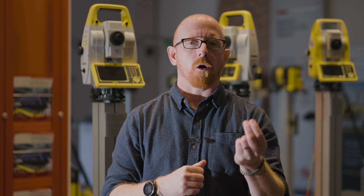We understand from you that you work in a wide variety of conditions and environments within building construction, and we also learn from you that sometimes these conditions are not always the easiest to work in when you're utilizing a robotic total station. For example, when working on wooden formwork decks, sometimes the instrument can go out of level and come back into level quite quickly, but you always then had to tell the instrument to carry on working and tracking to your prism.